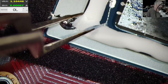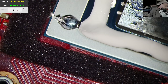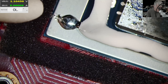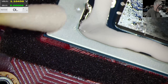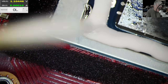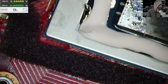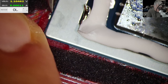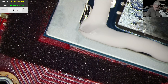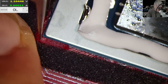Let's also solve the problem with the liquid metal. It was cracked from before, I believe. Check here — we have this liquid metal which went inside. I'm going to use a cotton bud and some alcohol, trying to get the things out. I don't want liquid metal under the CPU — that's the last thing I want, especially now after we repair the laptop. I don't think the liquid metal will go under the CPU because we have that glue. The glue is actually properly stuck there — so yeah, we are fine.